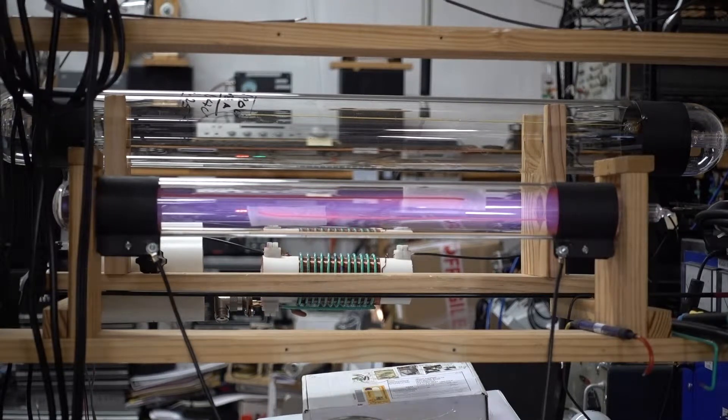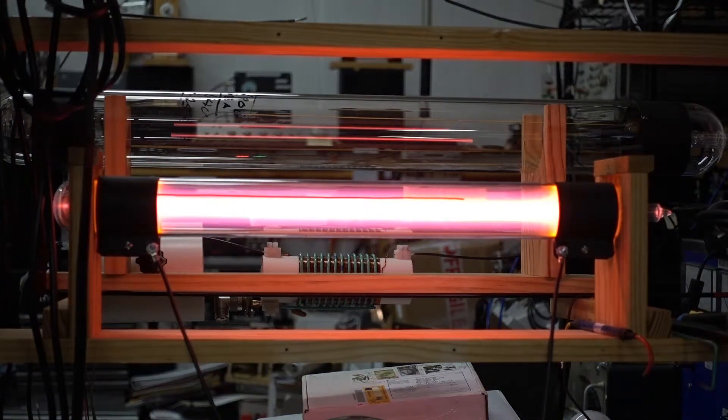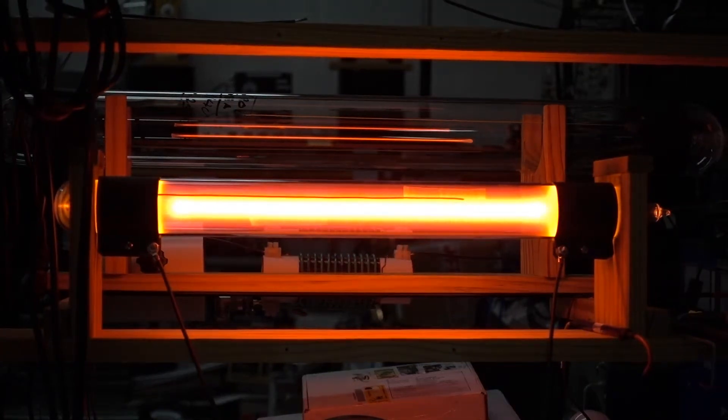We're going to raise the power a little bit. At this point more of the neon is ionized, but you can still see purple glow in there — it comes out as a whitish color in the video. That's normal for the tube; that's what it's going to look like until it's run for an hour or so. We'll raise the power again and let it run for a while to clean up the tube so it'll be in first class shape. This is normal for a startup on a brand new tube.